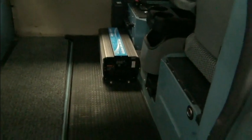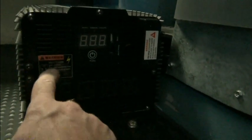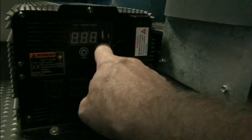Basically, just in from the door here a little bit, it's going to be consumed with our solar stuff. And on the inverter here, once everything's up and operable, we'll show it to you. Here's connections so that we could run 120 volt AC to whatever, hardwire it, and we have 4 15 amp plugs right there. So you can see it says maximum 1500 watts per outlet, which basically is normal for a 15 amp, 120 volt circuit. So anyway, there's also a USB port right there. So anyway, that's what's going on so far on the control part of our solar.